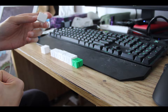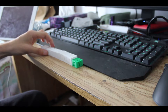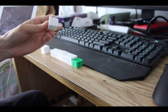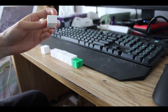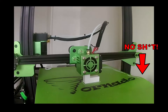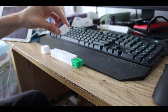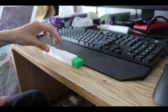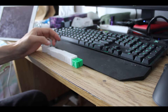So the first possible solution is that the nozzle can be too close to the print bed. This cube was printed before I removed my stock Tevo Tornado print bed. I thought that maybe my print bed was not level and it created a slight tilt or warp, raising the print bed up so that the first few layers would get squished together. This is the most common solution and it should fix most of your problems, so be sure to check this first.